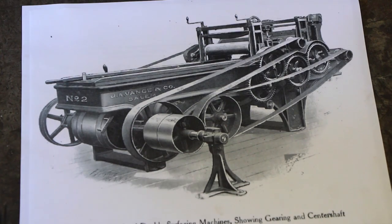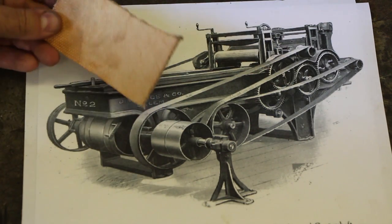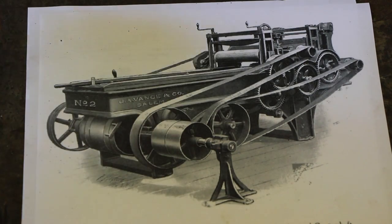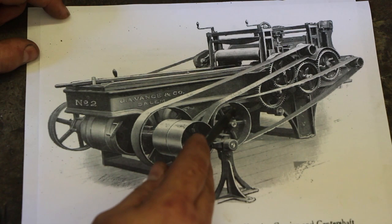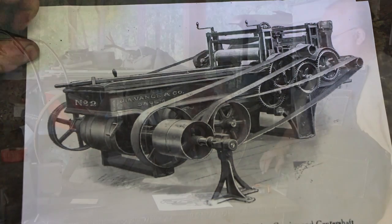So I actually went and got some belting material like we use. These are just little short pieces that I cut off from some flat belt material, and I measured the thickness of this stuff, and then I doubled that and added it to the diameter of the pulley I have, which happens to be the smaller one. And what you come up with is that the smaller one goes on this side. It's a little over 17.5 inches. The other side needs to be an 18-inch pulley. So mystery solved, and actually I didn't need that matching pulley. I needed an 18-inch pulley.